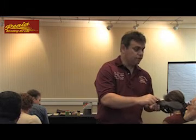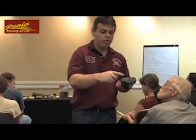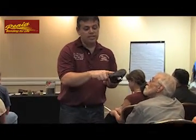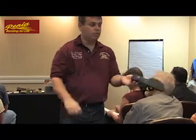But just test it with a little bit of solvent, a little bit of thinner, some spot remover on a rag, and just do a little spot. And you'll see the thermoplastic will leave a shine. It'll leave a little shiny spot where you rub it.